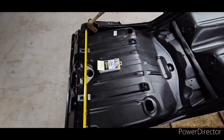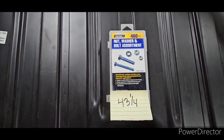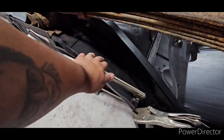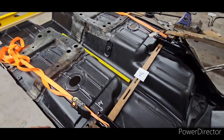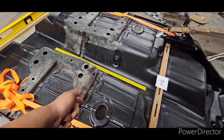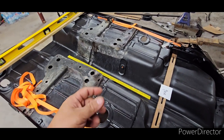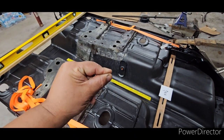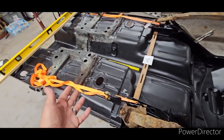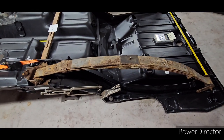The reason I have this bolt kit here that I bought from Harbor Freight is because when you see that the sheet metal does not fit nice and tight and you have a gap in between that you can't weld, what I like to do is drill a hole, put your washers on — one on top, one on the bottom, nut on the bottom — and start tying it down. It will bring the metal close to each other so you can make your weld nice and strong and tight. You want the sheet metal to be nice and tight when you're doing rear frame rails — these brackets have to be nice and tight so your plug welds are structurally sound.